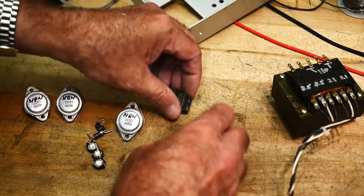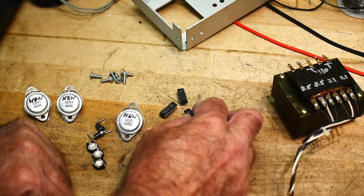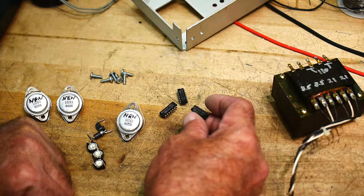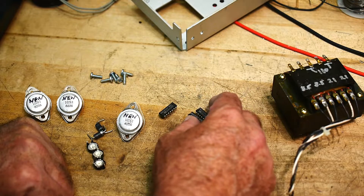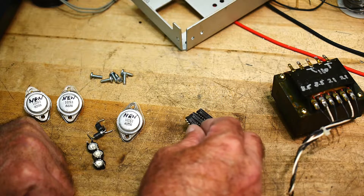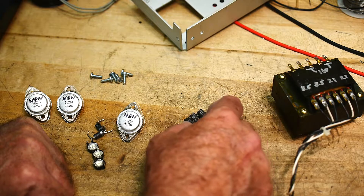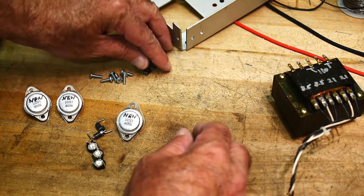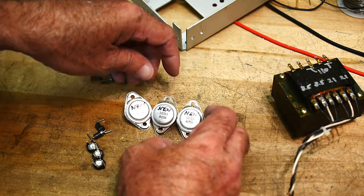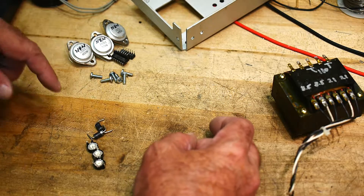There were some chips I thought were op amps but they're actually voltage regulators — old Signetics LM723s. Three of them. They're basically the guts of a three-terminal regulator, like a 317, just the smart part of it. I'll save those in case I need them for repairing something, but I'll just use three-terminal regulators — they're better. There were also some nice heavy-duty NPN transistors that test okay, Motorola ones, so I'll save those too.